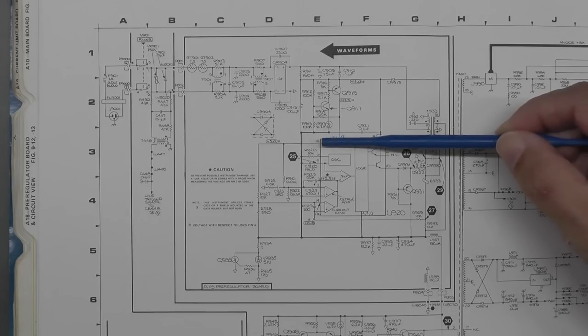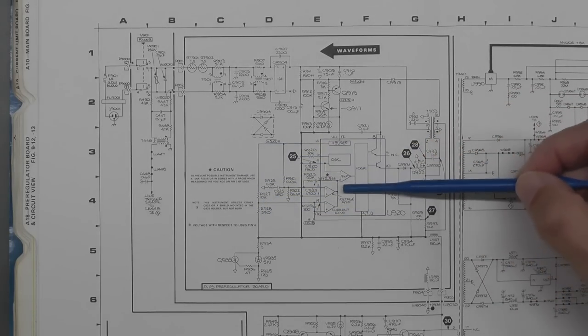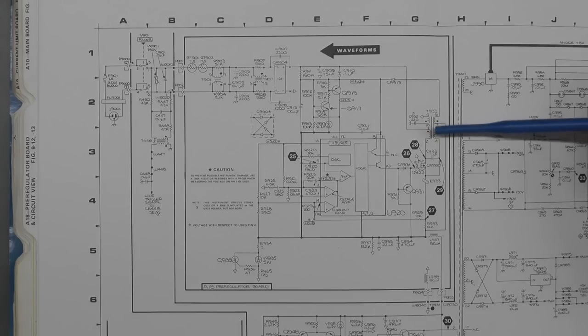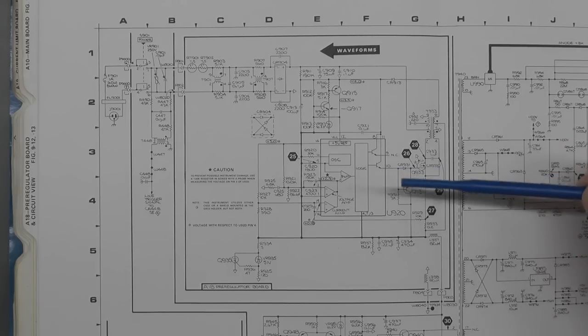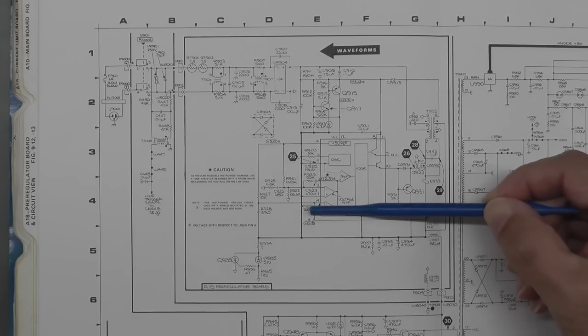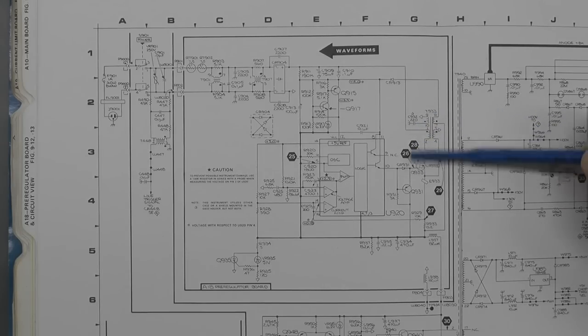On pin 14 of the TL494 is a very stable 5 volt supply, and that's fed back into this error amplifier circuit down here. The large DC supply comes onto one side of the primary side of this transformer, T933. The other side is driven by a MOSFET, which is controlled by the TL494. Now we also have a feedback mechanism to control the TL494. That's via R929, this 10K resistor here, coming back along here into the other side of this error amplifier circuit, and back up to this transformer here that's driven by the MOSFET.